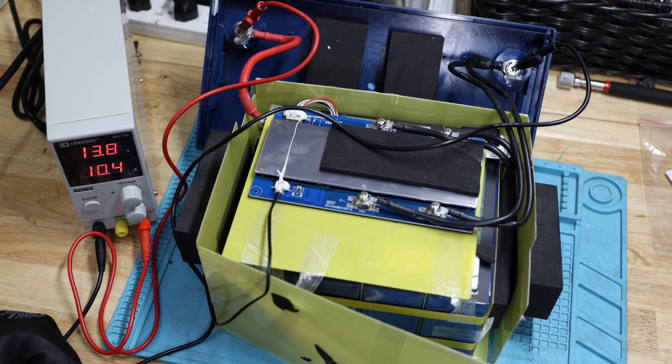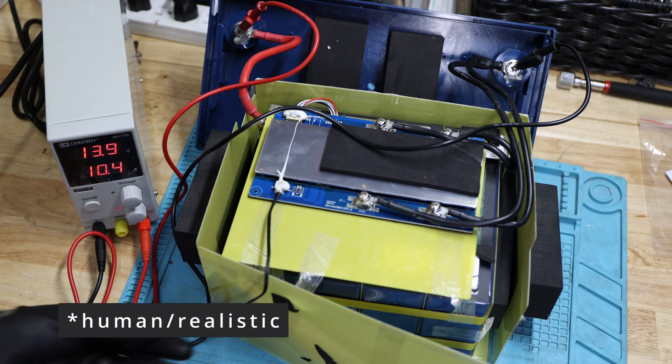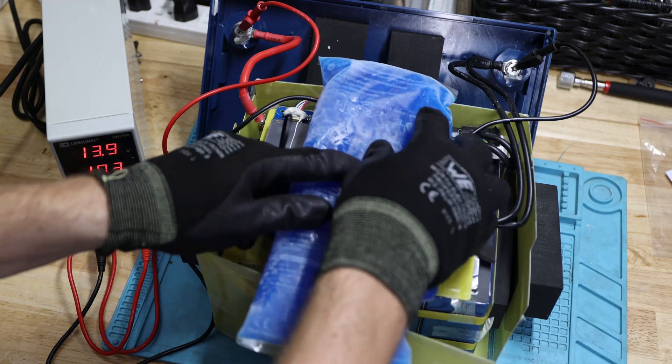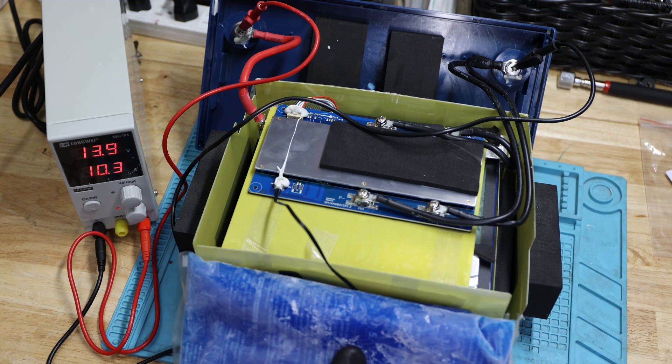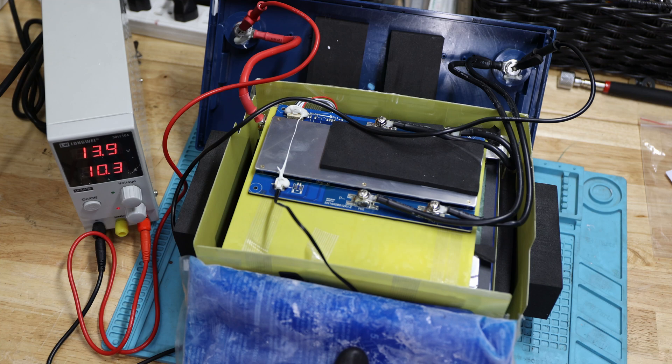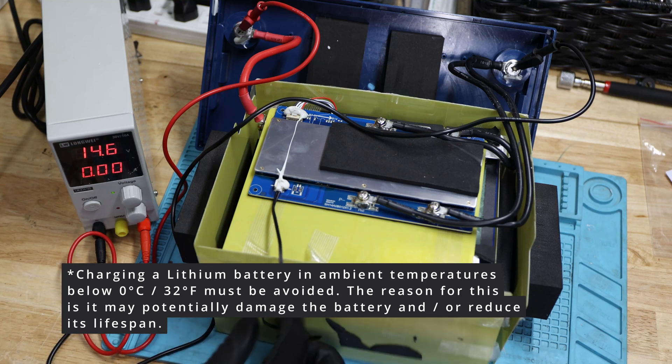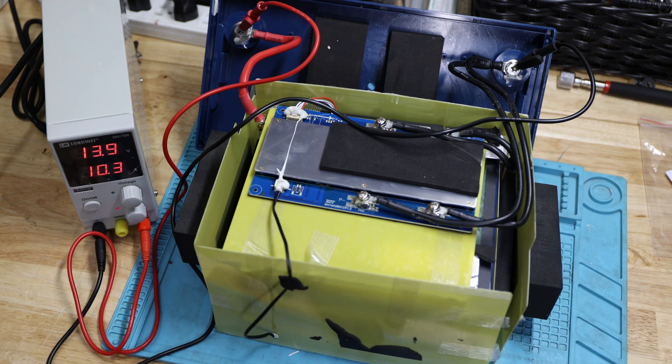Next test we'll do with the duster — ultra cold — and if that works, we'll continue with the actual ice pack to see if it does trigger in a more natural way at zero degrees Celsius or 32 Fahrenheit. So let me get this sprayed — there we go, nice. So it does work. Let's see how quick it comes back. And it's charging again. Not ice packs next — so since the duster can be way less than minus 20, ice packs are more solid to check if it trips in a more real-world scenario. It should stop charging at less than zero degrees Celsius. And it's back — nice.